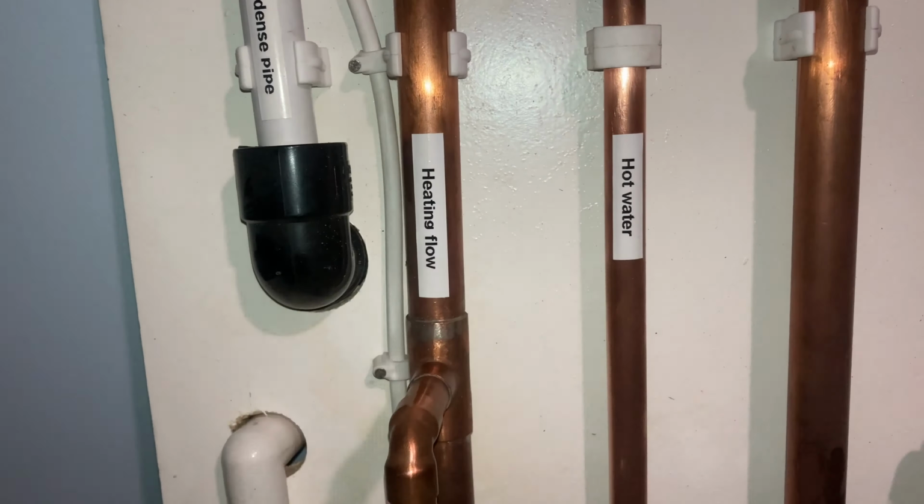Then on this fake combi boiler jig, you have the cold water pipe. The cold water pipe has a descaler on the hook. So you have to fit a magnetic filter and a descaler to meet manufacturer's warranty. And some boilers come with a 10-year warranty. So you've got to be a good installer and meet their criteria. So a descaler. This one is a Fernox one. Highly recommend Fernox. Been using them for over 10 years now. And they support the charity.